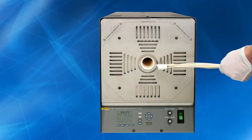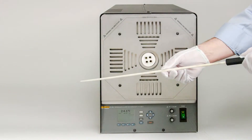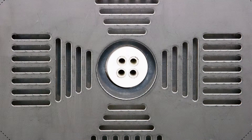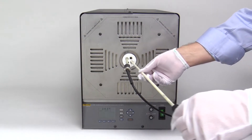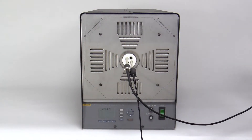Base metal thermocouples are often wrapped in materials such as braided fiberglass or PTFE. During calibration, they are bundled around a reference thermometer, held together with fiberglass cord, and inserted into the 9118A. Metal or ceramic sheathed thermocouples are normally built with noble metal thermoelements and have higher calibration accuracy requirements. The 9118A with an isothermal block improves heat transfer and stability, better equalizing the temperature between the reference probe and the unit under test, which lowers measurement uncertainty compared to a calibration without a block.